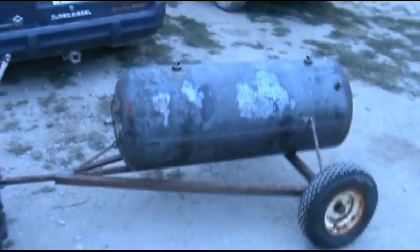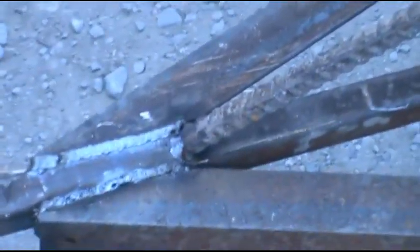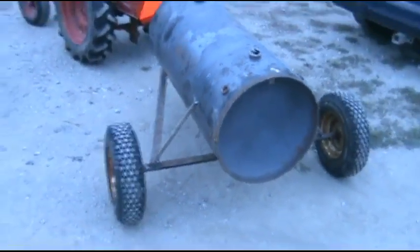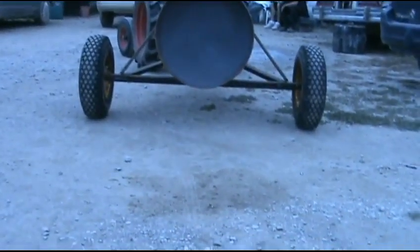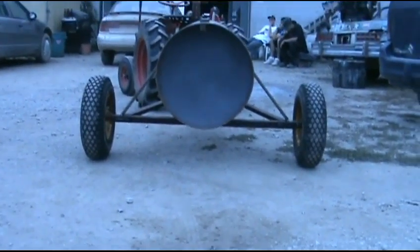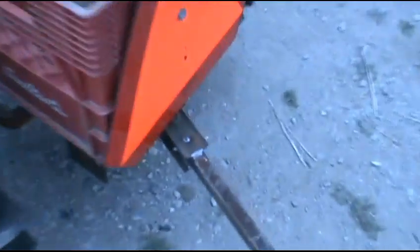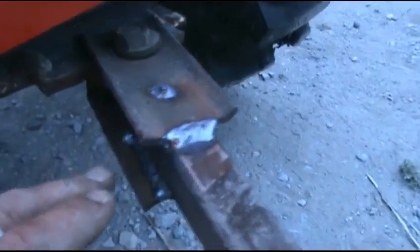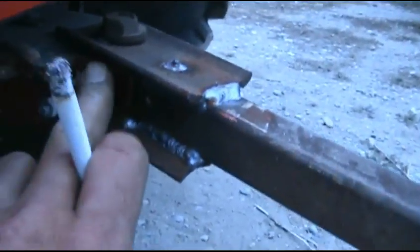All right guys, there's the single tank — I think I might be okay with just a single tank, we'll find out. All I did to brace it was weld some rebar on there, same at the back. Underneath I have a bolt on either side to keep it centered, but I'll have to beef up that angle iron for the axle. For the tongue, I just cut a lawnmower blade and torched two holes top and bottom on either side of the one inch square stock so it slides over my hitch. That way it doesn't come up or down — perfect.